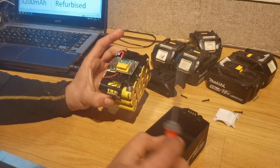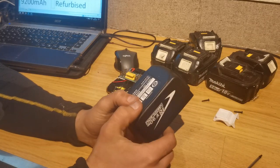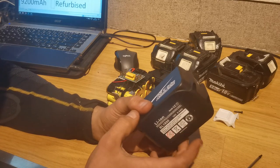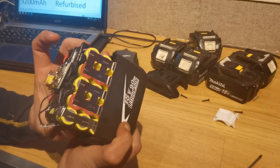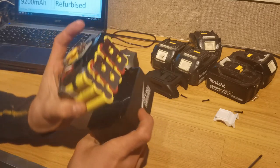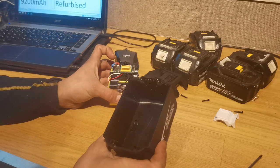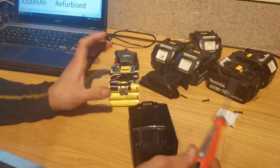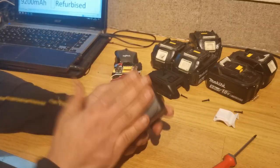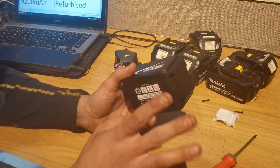Battery is excellent. The board, okay. We have some protection, but no drainage, that's bad. So even if you buy it, the price is good, it's 9.2 amps maybe, but no drainage. So I need to drill here. Let me check. The safest spot to drill for yourself is, what could it be? Yeah, I would recommend buying a T10 screwdriver and taking it apart, drilling four holes in each corner, and this will help you a lot. I will do it. Before I even start to test this out, I'm going to put the holes in.